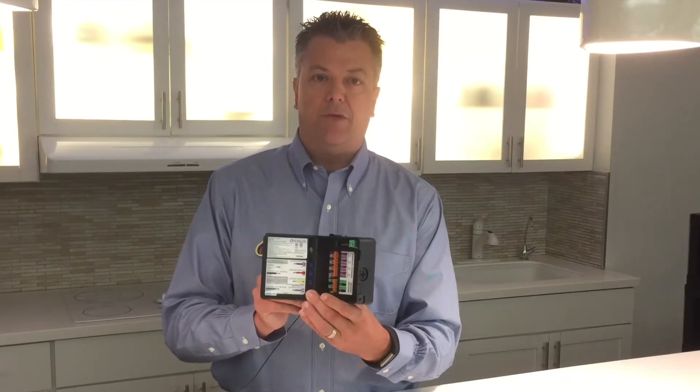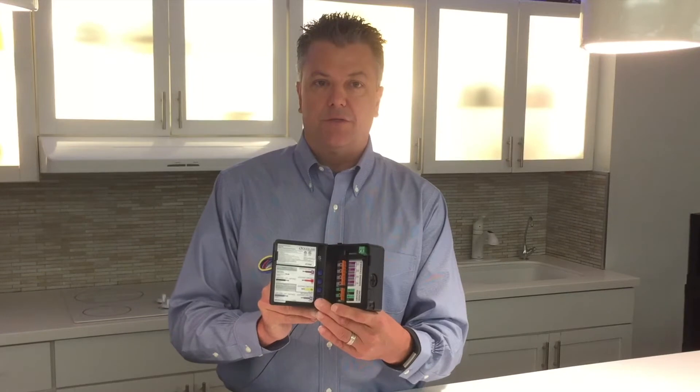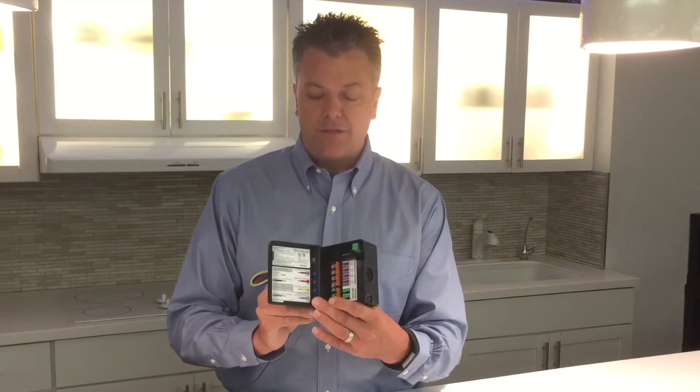The fourth relay can be tied to a different power supply. This allows you to control lights that may be fed from a different source, like under-counter or track lights, or it also allows you to control things like receptacles.